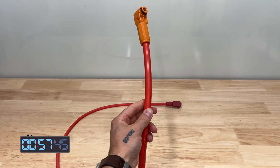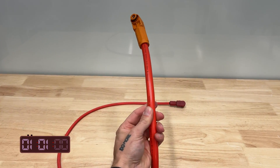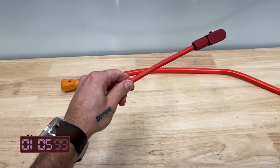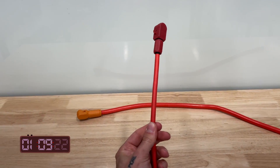The main thing to understand here is that volts times amps equals watts. So if you decrease the pressure — say from 120 volts down to 48 volts — you're going to need a much thicker hose to get the same amount of water into that bucket. Applied to real life, that means thicker gauge wire to deliver the same amount of watts to your inverter, as opposed to a thinner gauge wire at a higher voltage.